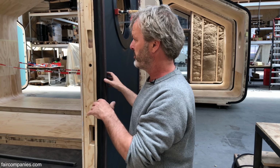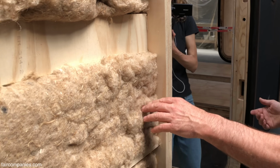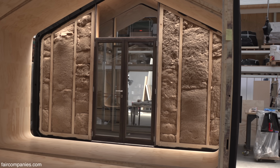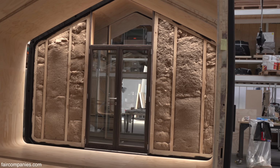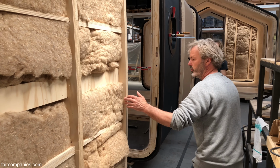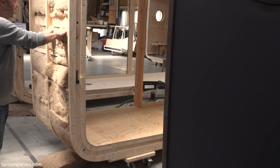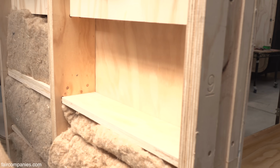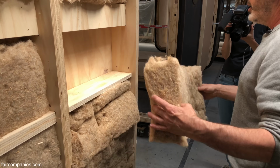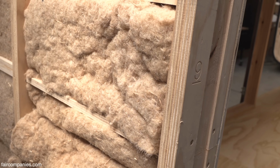Besides this cardboard element, we've also made one which is insulated by flax, because water is such an issue, and on a facade, at the end there are of course the windows, and that's vulnerable. So that's how we developed from this. We also developed this one, which is a more ordinary way of building, just a wood skeleton, and then we put in a natural insulator, which is the flax. So we combine a very alternative way of building with a very traditional one.